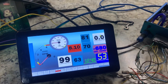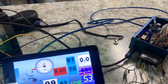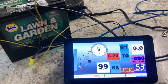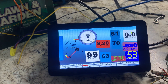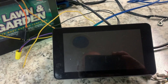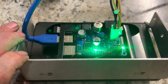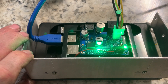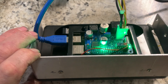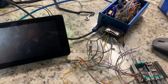Anyway, it's just a short little video — there's a lot of stuff in the background I've been playing with. To shut it off, you just click the ignition off, and it takes about 20 seconds — there it goes off. On the back I have a delay timer set up, so another 25 seconds after I know for sure the Raspberry Pi has shut down, it will turn the background power off. Anyway, that's just something I've been playing with — have a good day!